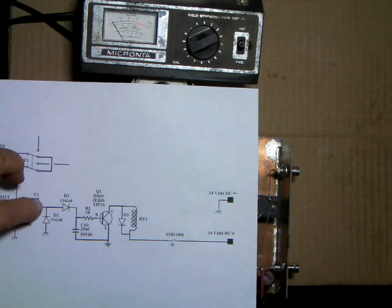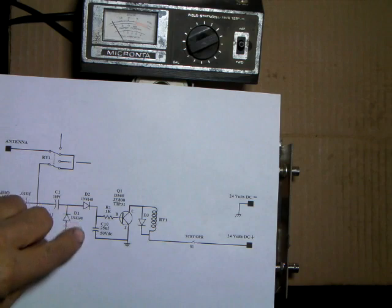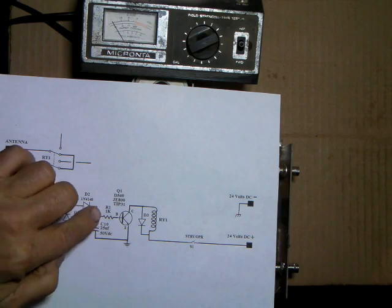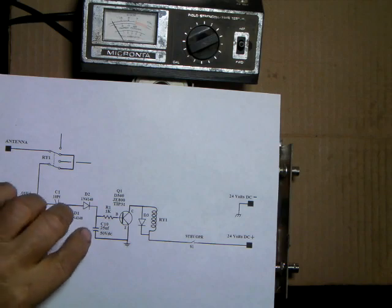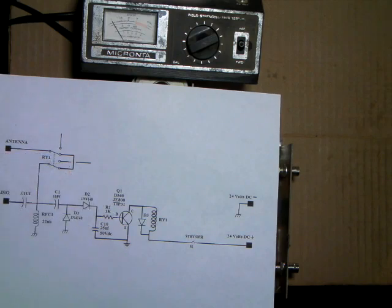We got a couple diodes. They're in the form of a voltage doubler. And they charge a cap with a positive voltage. And we use a 1K resistor tied into the base of a transistor. And this is kind of a timing circuit. If you were to use sideband, instead of going larger on the cap, you could just simply switch a larger resistor up to maybe 4.7K if you wanted a time delay.